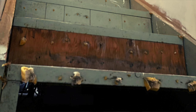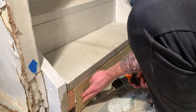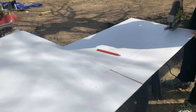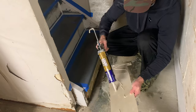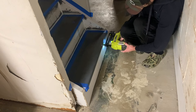For my staircase, I chose to reuse and just paint my existing risers, except for the bottom step where there was no riser at all. For that, I took a two-by-six piece of lumber, put it in with some screws, and then used some leftover hardboard from my cabinets, cut it as a riser, and stuck it in place. If you want to replace all your risers, you can buy hardboard from your local big box store. Apply the new hardboard riser using construction adhesive and brad nails to secure it in place.